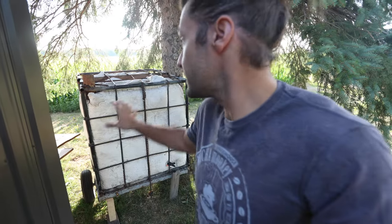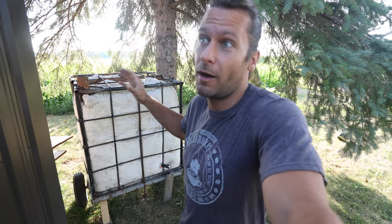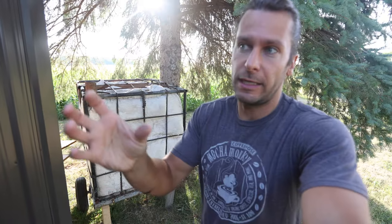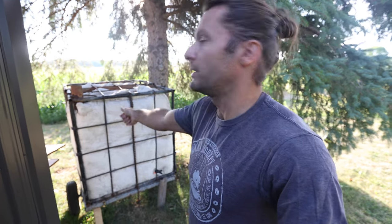This is our raku kiln — it's made to fire up really quickly. It's all fiber blanket, which is another type of insulating material different from the bricks in the gas and electric kilns. Fiber blanket allows you to open the kiln when it's at 1,800 degrees and take the pots out. The kiln hinges open and we take pots out when they're at their hottest. With gas you can also do soda firing — where you put baking soda in the kiln and it fires onto the pots — or salt firing. There are just tons of different types of firing, all using gas to heat it up.